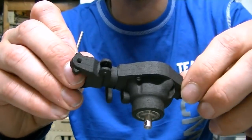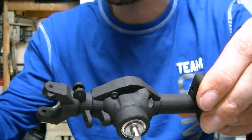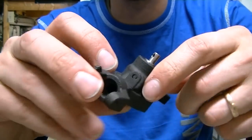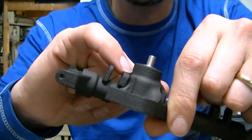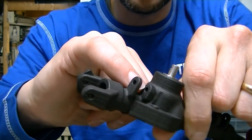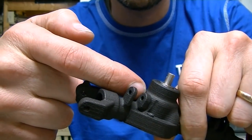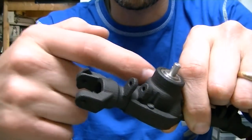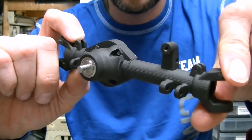One of the reasons this matters is because nylon dust is extremely dense. It makes a great axle housing, but it doesn't compress very well. So for instance, if this hole bottoms out inside the diff part and you didn't clean the nylon out of that hole, then you try to jam a screw in — it's actually just going to stop wherever the dust is, and then it's going to strip out the rest of the threads. You won't get a proper bite on the thread in that hole if it's got dust in it. You must clean those out.